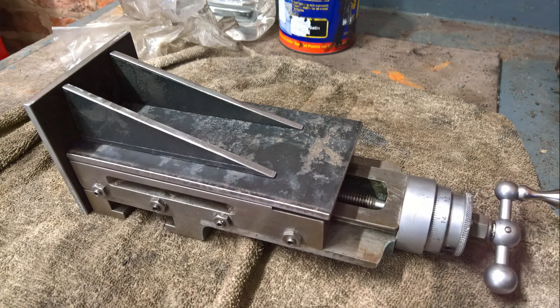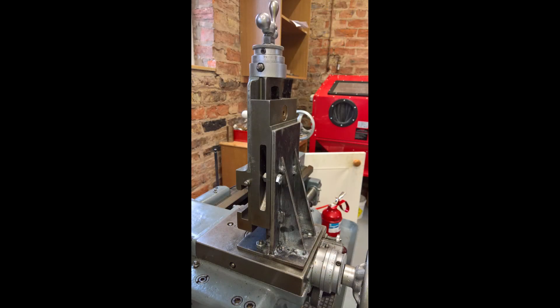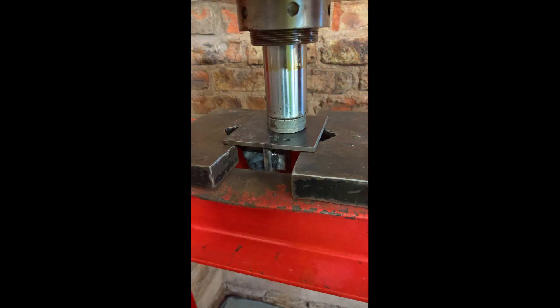This was the vertical stand before welding. I tried to do the minimum amount of welding and also to weld on opposite faces to try to reduce the amount of warping. On the subject of warping, you can see the base plate is no longer flat, circled in green. So I cut the offending welds with a die grinder and took it over to the press to flatten the base plate, then re-welded it — and this time I got it right.